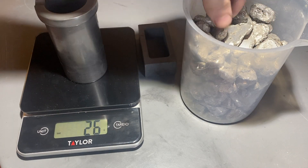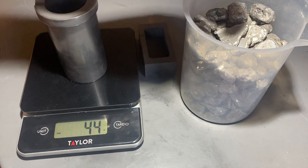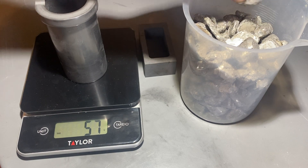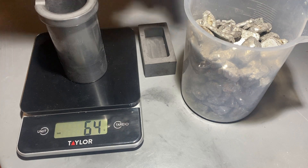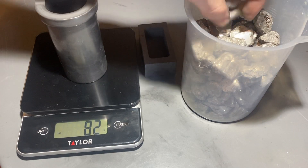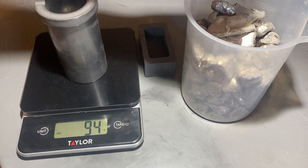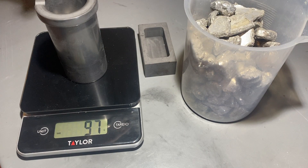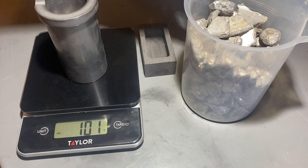It's one of a few aluminum alloys specifically designed for casting. Many people say that aluminum is not great for casting, which is true — most alloys are really bad for casting, but this one has been specifically engineered for this purpose. It is used in things like cast pistons and car wheels. From my personal experience, I've had very little issues with flow because it has such a high silicon content. It also has good high-temperature properties and a low coefficient of thermal expansion.